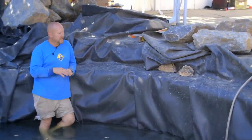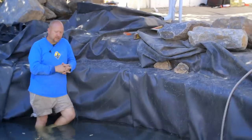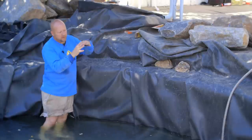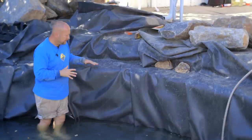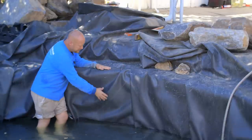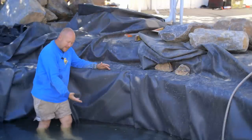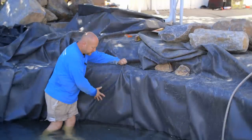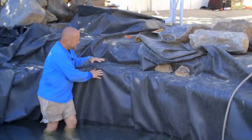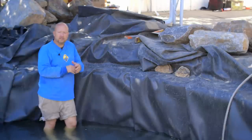The pond's filling quickly, and I'd like to move straight to setting some coping stone, but I have to be patient. If we go around the pond and start to put our coping stones into place, we pin the top of the liner — it can't move anymore — and we get this slack. The way to get that slack out is to let the pond continue to fill up all the way. Once it's full, everything will be pressed out, the wrinkles will be limited, and then we can start setting the coping stone.